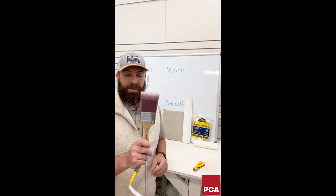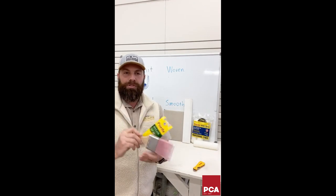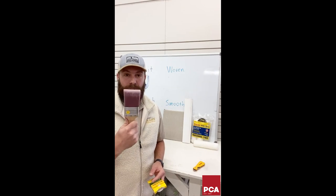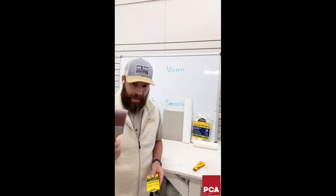The Nylox has just enough stiffness to push enamel around but soft enough that the bristles aren't digging into the finish, giving you an ultra smooth result. I've challenged people who love mini rollers for cabinets and trim — they work fine — but I can get one of the finest finishes ever with one of these. I hand-brushed trim in my own office with the Nylox, and it was indistinguishable from the sprayed trim.